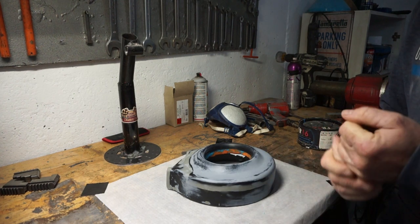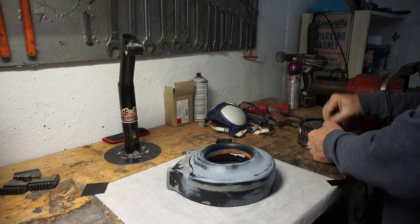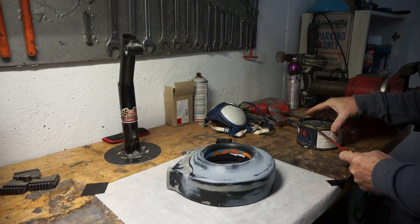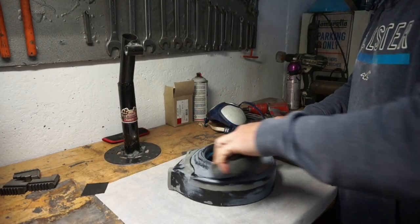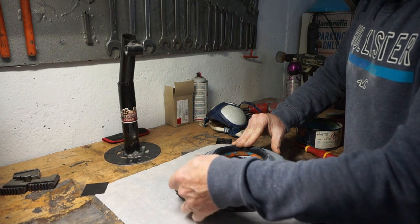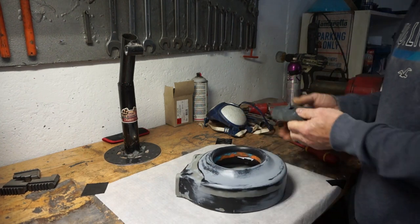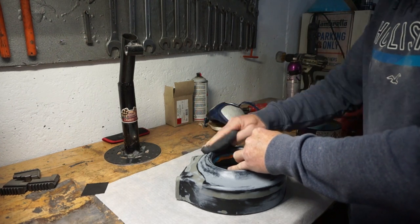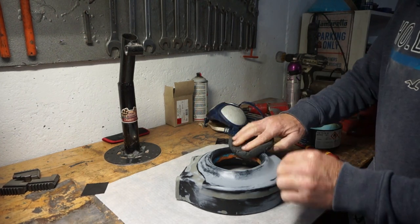We've got to proceed in waxing it up, and apply a little bit more wax now. So we'll just give it a bit more. Once it's dried out a bit, we'll give it a polish off so we get our mould as clean and shiny a finish as we can. Better result.